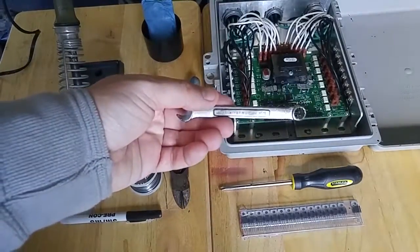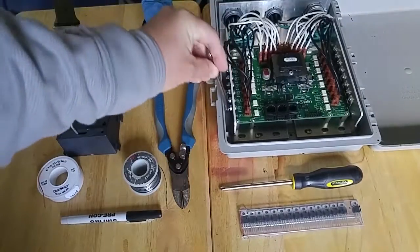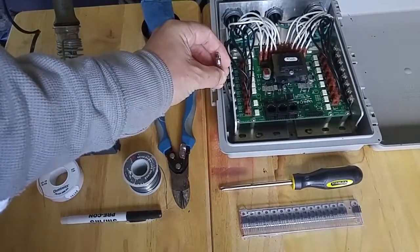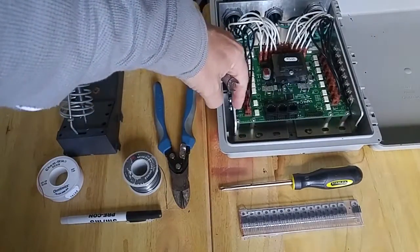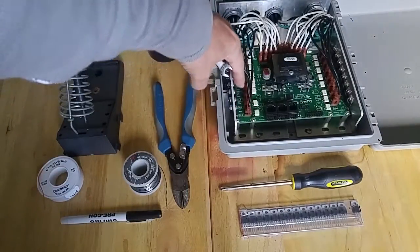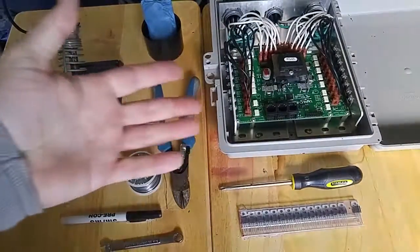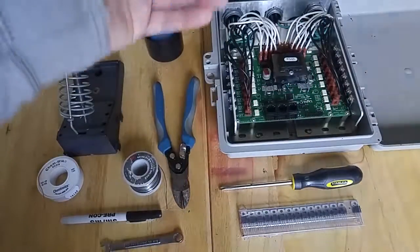Five-sixteenths is what I've got here — it's fairly close to that nut. It's a little loose but these are not super tight, so you just need to hold it while you unscrew the screw that goes through, because the ICs are connected to this heat sink. You have to have thermal paste on the backside of these ICs because this heat sink will generate a lot of heat.